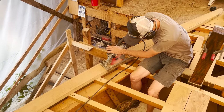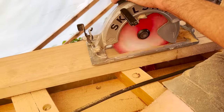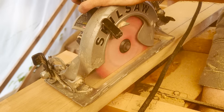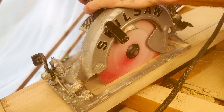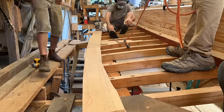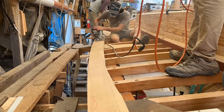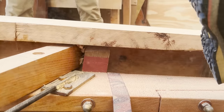And I want to raise it like a 16th. The blade is set to cut to the bottom of the covering board. I just don't want to cut into the deck beam, so I'd like a 16th of an air gap between. That's all we're looking for. And then I'll have the compressor fired up. Basically, if someone can tend to the cord on the circular saw so that it doesn't get hemmed up and I don't have to think about that. Probably that same person can follow me with the air gun and every few minutes give a little blast in front of me and make sure that I can see the line well. And then if someone wants to go just ahead of that, pop some screws and tuck a couple light wedges.